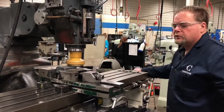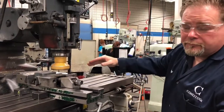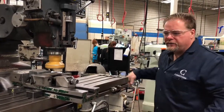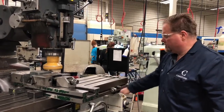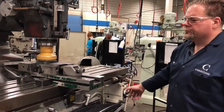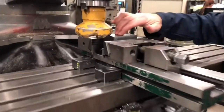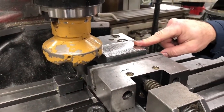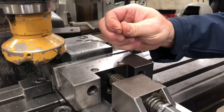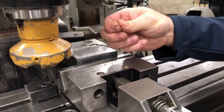Here I am touching off. We'll take a smaller amount — we're not cleaning up fully. You can use your power feed or feed by hand. That's about the kind of finish we want with this cutter. We don't want it super shiny; you want it kind of grayish. And you always want to make sure that you're taking a chip — you don't want to be spinning it so fast and feeding really slow that you're getting shavings instead of actual chips.